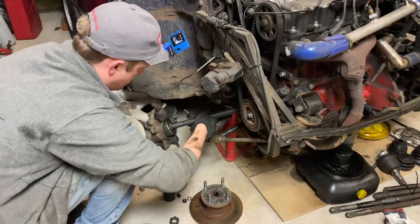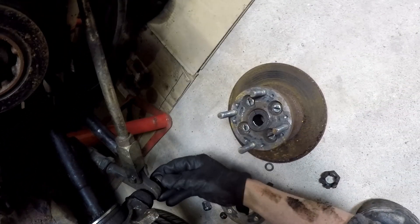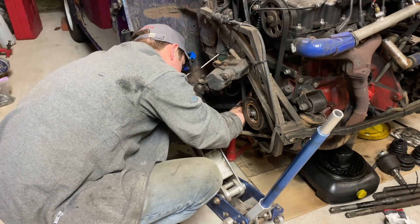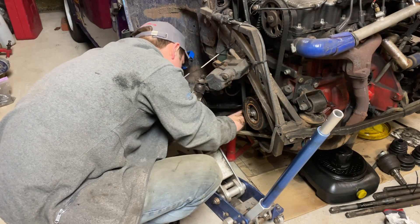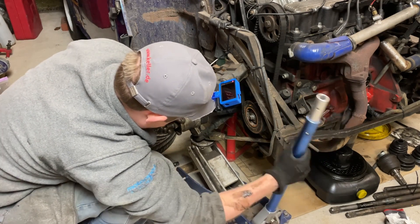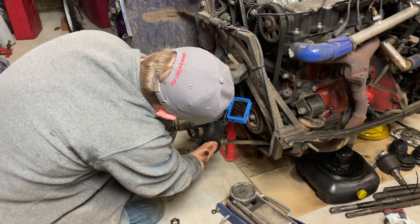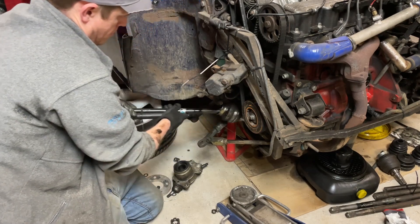So the length of the shaft is just as dependent on the suspension movement as it is on the gap between the wheel and the gearbox. The easiest way to work this out is to cut the shafts down to a sensible length, strap them together with a healthy amount of overlap, and put them on the car. Once on the car, we move the suspension to normal running ride height, put the inner shaft in the middle of its plunge on the inner CV joint, and put a line across the two shafts so we know their position relative to each other. Then we move the suspension through the whole range of motion — as long as those marks don't move, we know we're not bottoming out. That all looks good, and at the very bottom of travel I can see there's a little bit of movement left on the inner joint, so that's my shaft length.